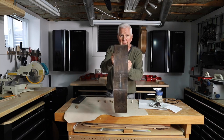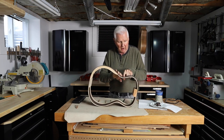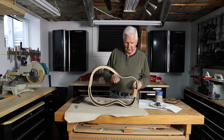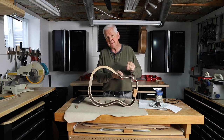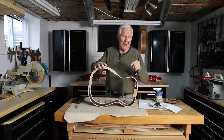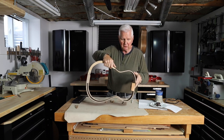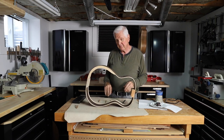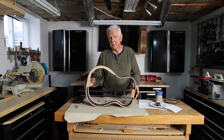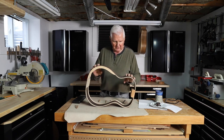What I also did — if you can see that — is I have marked each end of the patch that we put in. I've now marked the center of the guitar. I used a flexible ruler here and I bent it down and drew my line, so my jig will fit over this and then we'll punch this in. I've never done this before without the top and the back on, so I'm actually thinking maybe I should give it a try because it would be much easier to sand the patch on the inside once I've drilled through that with the router. We're about one or two videos away from getting into the top and doing the rosette and putting in the shell and all of that good stuff.